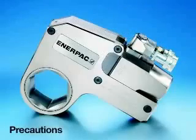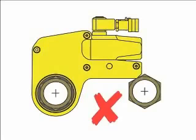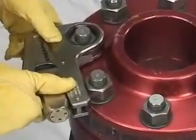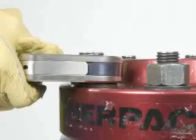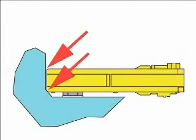Safe handling of the W-Wrench — some do's and don'ts. This is how to properly locate the W-Wrench using the reaction arm. If the reaction arm is placed incorrectly, it may actually damage the nut or the wrench. Incorrect placement can also occur if the nut is too close to the wrench and the reaction arm cannot be positioned properly. Be aware of pinch points from the reaction foot — the reaction foot can pinch your fingers or the hose if you are not careful. Correct use and location of the W-Wrench is shown here. Make sure the W-Wrench is balanced as in this view. Incorrect use occurs if the W-Wrench is placed improperly on the nut and associated surface. Damage could occur to the nut or the W-Wrench, or injury to the person holding the wrench.